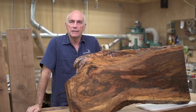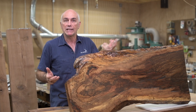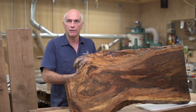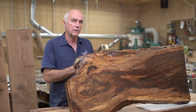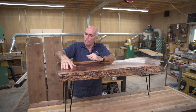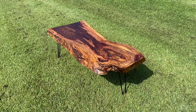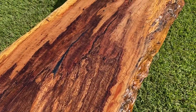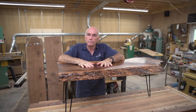Here's the reason why I think a table needs to be flat — it's pretty simple: I think people expect it to be flat. I'd say 90% of people out there are looking for a flat coffee table, and they maybe don't look at the spalting or the figure in the wood. If it's not flat, you're going for a much smaller part of the market. The table is not that bad — it's got a little bit of cupping on this end and a little twist throughout the length. I could have flattened it, but there wouldn't be anything left — it would be too thin, you wouldn't get the effect of a slab, and there would be very little live edge left. So I just left it the way it was. Let me know what you think in the comments — does a coffee table need to be flat, or is a little warp okay?